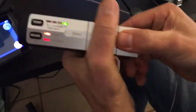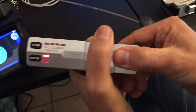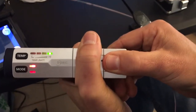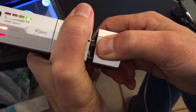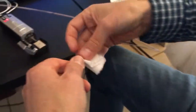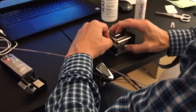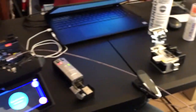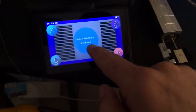We're going to do three times: one, two, three — putting a lot of pressure with my right thumb and then a steady, slow pull to get it off. Strip it, clean it, and now we're going to cleave it. Put it in here and that looks great.